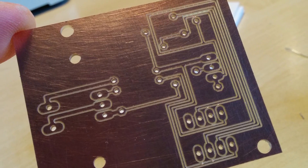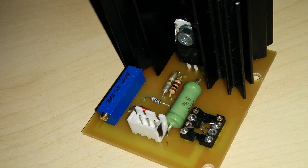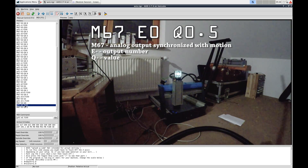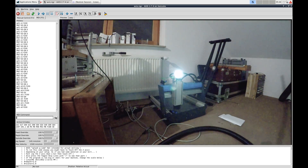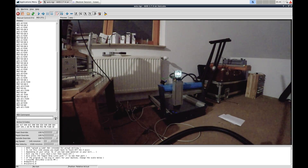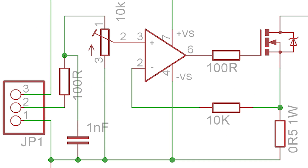I made a quick prototype. Seems like I'm getting reasonably good at PCB milling, but I wish for an alternative nevertheless — and it seems like one is on its way at this very moment. Let's give it a try: 50% duty cycle. And as M67 is called 'analog output synchronized,' it happens at the next movement. Let's try 100% — like a champ. Now, even at 0% duty cycle the LED continues to glow faintly — 20 milliamps to be precise — and I think that's because of noise going into the highly sensitive op-amp input. To eliminate it, I added a simple RC low-pass filter to the finished circuit.